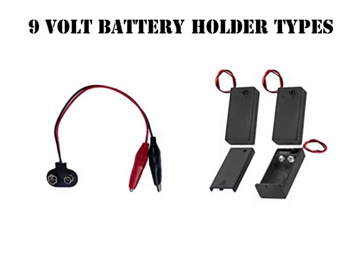Next we're going to talk about 9-volt batteries. A lot of the Warsaw Pact phones, as you can see on the sheet, actually use 10 volts and have really crazy-shaped battery compartments. The easiest thing to do is get one of these 9-volt battery holders. I have both styles, but I find the alligator clip ones are the best — you can reach in and clip them onto the contacts. One phone has snaps inside and the other has contacts you press a battery into, but the alligator clips work great.